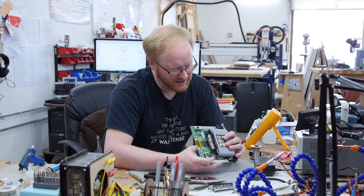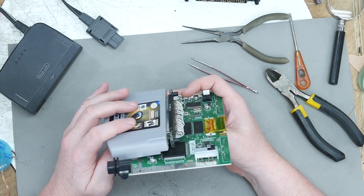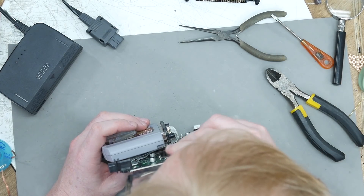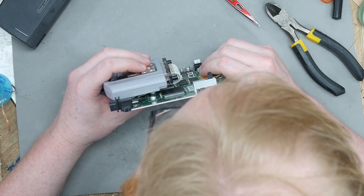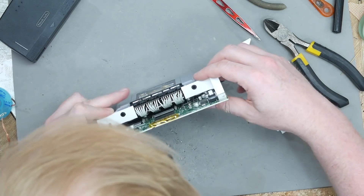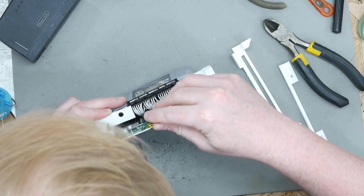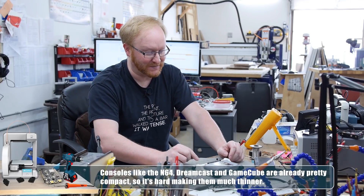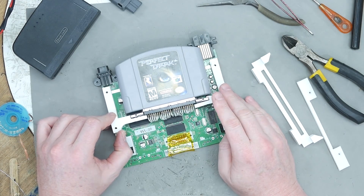I can't just plop down a big block of metal — I'll probably try to mill some fins into it as well. From the end view, I need about a quarter inch of space above the chips before I hit these wires. I'm concerned it might move the cartridge up too high and not fit the mounting pieces I've already printed. The wires could be moved up closer to the cartridge to give it some space — that's one reason I was adamant about making the memory expansion and jumper termination header as small as possible, to leave lots of room for airflow and heat sink material.